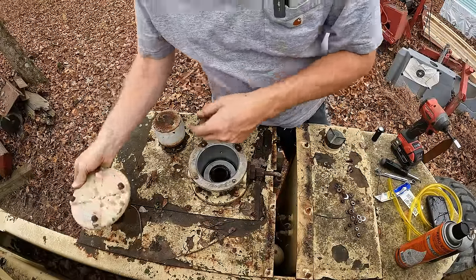I can see we're going to have a pile of electrical work to do here, but I think the whole project as a whole is sound. It's going to be worth the investment. Before I dare climb out of this basket, I'm going to e-stop it so that way I don't climb down and the things start taking off on me because the controls have ghosts in them right now.